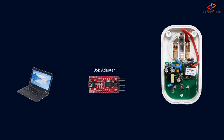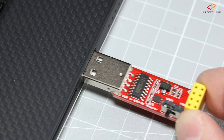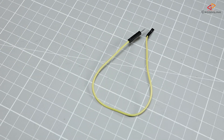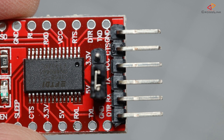How do we flash new firmware on these devices? As I said, there is a serial interface on the boards, so we will need to use a serial-to-USB adapter to connect that to a PC or Mac. These adapters come in all kinds of different shapes and sizes — I have some examples here, and I've also linked them in the description. They all have in common a USB interface: this one has a USB-A connector you directly plug into your PC; others might come with a USB mini connector where you need to use a cable. What you will also need is four jumper wires to connect the USB adapter to the serial connectors on the Sonoff board.